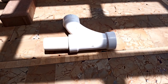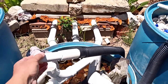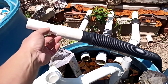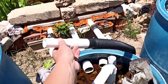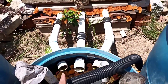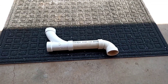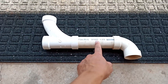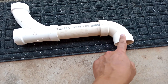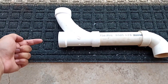I'm about to connect this into the pipe and show you more. This is what it looks like when connected to the pump. This pipe here eventually leads straight to the pump, so the pump will push the water out. Next step: I get a few inches of the one-and-a-half inch pipe and connect it to this tee, then connect to this 90-degree elbow. This is the complete venturi.